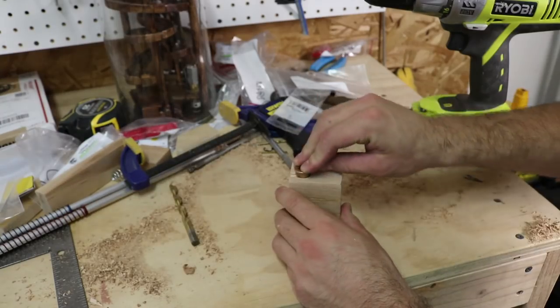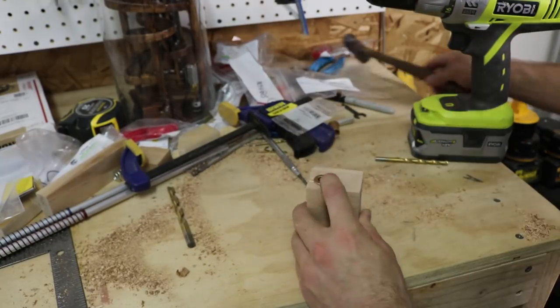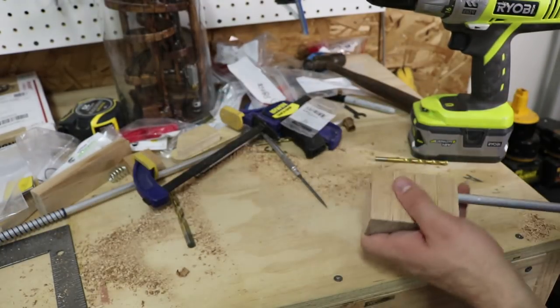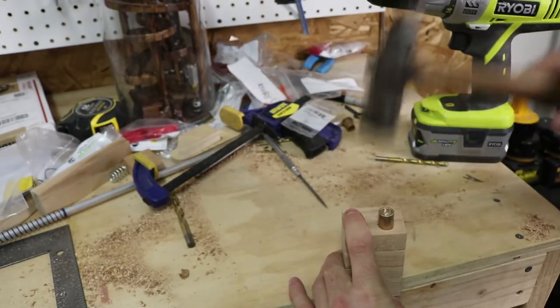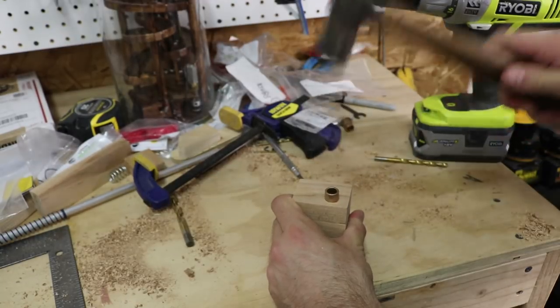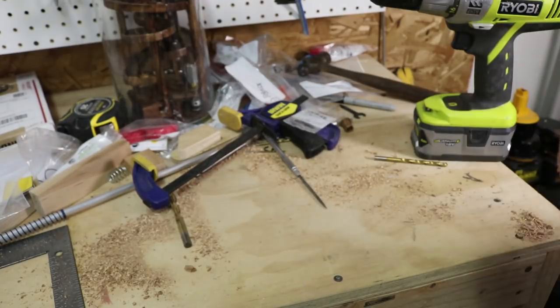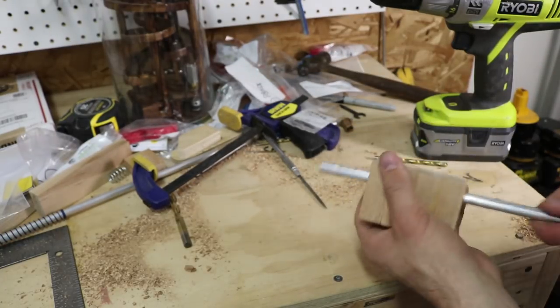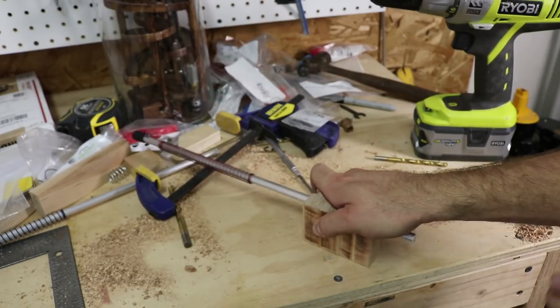On the pinball side, I hammered in a bushing with a lip for the red or blue spring to press against. This way, the spring is pressing on the metal bushing and the metal E-clip. If it was pressing into the wood, it could cause problems down the road. I toyed around with the idea of having multiple bushings for the same plunger, but I had alignment issues that kept it from working smoothly. So that first bushing with the lip around the front will be the only one.